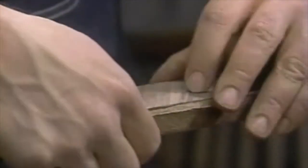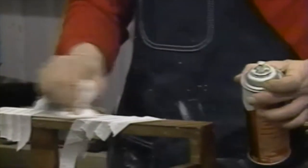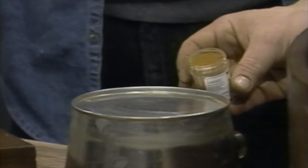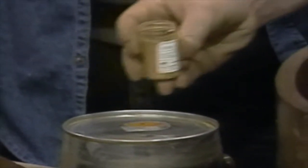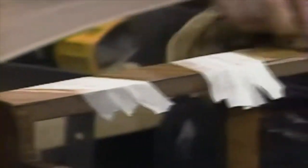You've got to be careful when you press this down — you don't have too many chances; you've only got one chance, as a matter of fact. This is a white lacquer I'm putting on — that's going to make it lighter. Rather than bleaching it, this is another technique. I'm going to take a dry powdered stain which is almost the color, put some in, using the bucket as the palette, with a little clear lacquer. And then with a rag — it's coming up golden. It's going to need some color adjustments. Get the basic foundation color in first.